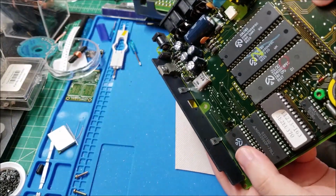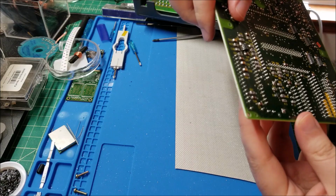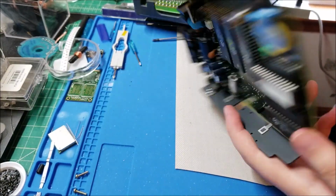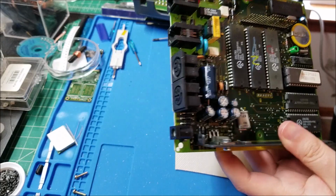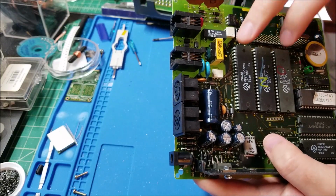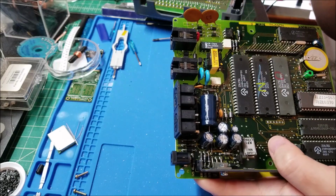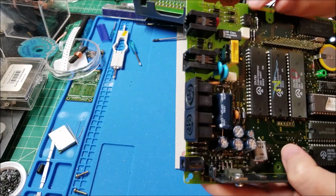This other chip here has its own crystal, 11.0592 megahertz. And not really sure what that does right off the top of my head. It looks like a couple of traces go off to the top here and wire to maybe the PIO, somewhere like that. We have some optical isolation because there are two phone lines. So we have number one, the transformer here, and it's just going to be like a common mode. We have some metal oxide protection devices here. We have photo interrupters and likely another one, NEC.